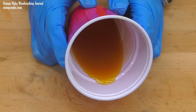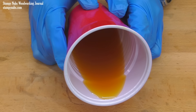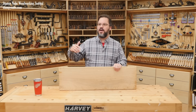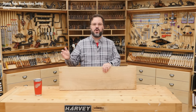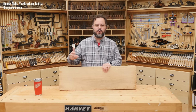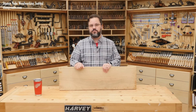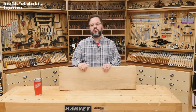You'll need an oil-based finish — anything that hardens will do. It doesn't even have to be the finish you intend to use for the rest of your project. If you have an old half-can of glossy polyurethane or something you just want to get rid of, use it. It'll have no effect on the sheen you end up with when you put on your actual coats of finish later. You can even use boiled linseed oil or tung oil, as long as you give it enough time to cure when you're done.